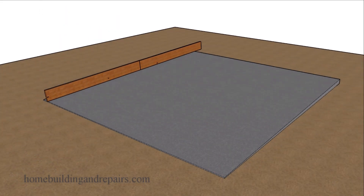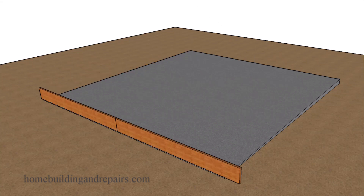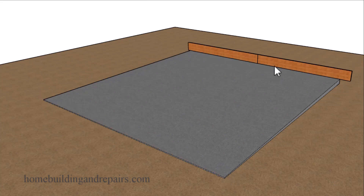I'm not going to tell you what this measurement is because yours is going to be different than mine, but if you need an example let's just pretend like this is five inches. If it is, then I'm going to deduct five inches off of the height of the wall framing studs I'm going to use on this wall here to build the wall in the back. You can always reposition the board to establish a level line across the front and a level line across the back. Sometimes these sections aren't going to be level, and you might need to start with a high point and a low point to create upper level wall framing plates.